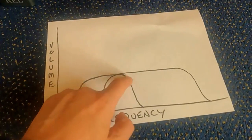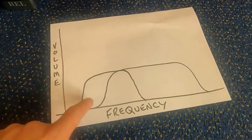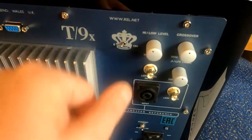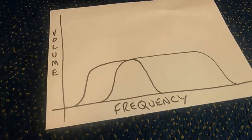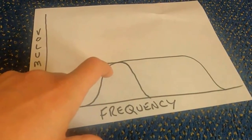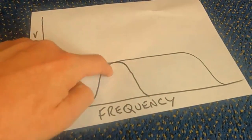Here's a sub in an ideal situation, perfectly matching the roll-off. So as the speaker starts to roll off, the sub takes over. There's a bit of a crossover point here, and on subs there's usually what we call a phase switch — you can invert the phase. That's something to experiment with, because it means anything in the crossover area could either get a doubling effect or, if it's 180 degrees out of phase, anything in that area gets cancelled out.